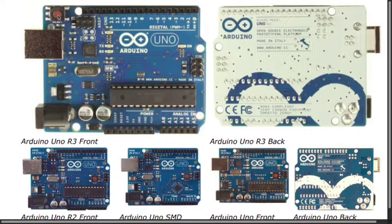For example, if you upload your program to the Arduino to perform your desired task, you can use that reset button to reset the program to its initial stage from where it will start again. It's just like the reset button we use in games. And the ICSP header, ICSP basically stands for in circuit serial programming, and it does all the advanced functionalities that are desired. The ICSP header allows the microcontroller to receive the firmware or program which you will be programming through the Arduino IDE.